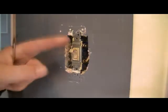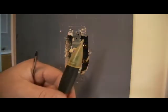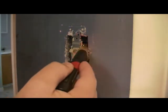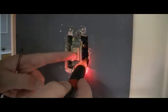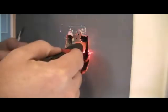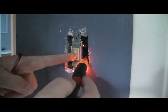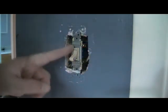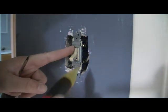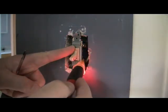You can see the light is definitely still on. We're going to use our voltage sensor — our voltage tester, whatever you want to call it. It seems like we've lost power on one side of the switch, but if you take this out now and start working on it, you quite possibly could get a shock. So we're going to turn off the power at the panel.